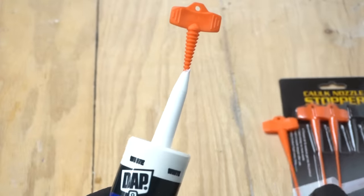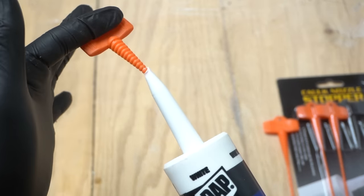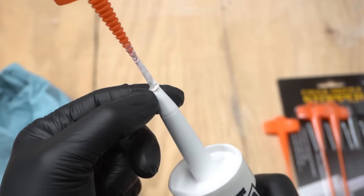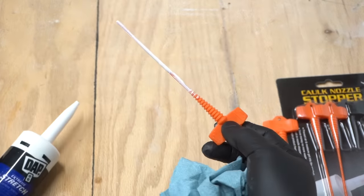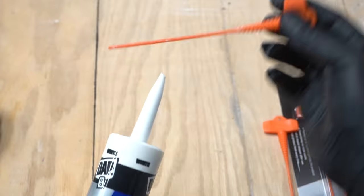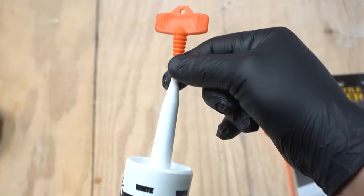This caulk nozzle stopper is kind of similar to a screw. I do have one I installed a couple of weeks back, but the only issue is it looks messy. If you store it with other caulking tubes, having it bent can disturb the seal. Another issue is it kind of messes up the hole — if you're doing precision work like baseboards and you shove this in, it's going to deform the tip. Every time you take it out and reuse it, make sure to wipe it down immediately, otherwise you'll get buildup, and dried caulk buildup can allow air back in and break that nice seal.